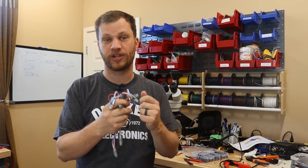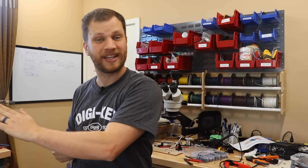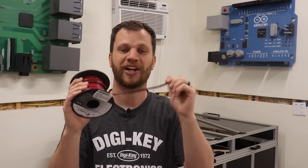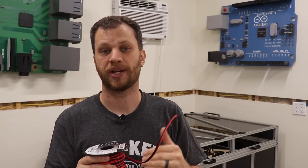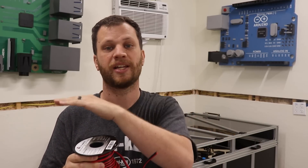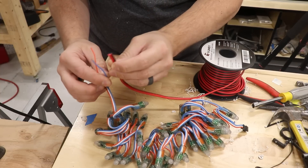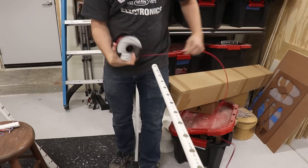When you start daisy chaining these LED strings together over a long distance, there's going to be a voltage drop at the end of the string. The beginning of your string might be at 5 volts, but by the time it gets to the end it might be at 1 or 2 volts — and that's not enough to properly get all of the colors out of the LED. To mitigate the voltage drop issue, I'm going to install some 16-gauge wire inside the PVC pipe and connect it in parallel to the 5-volt and ground wires already included on each string. This gives me a much more reliable 5-volt source running inside the PVC pipe the entire length of the string, and I can tap into that supply at each connection point.